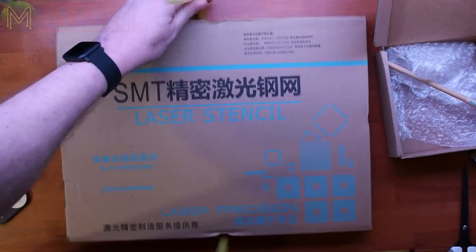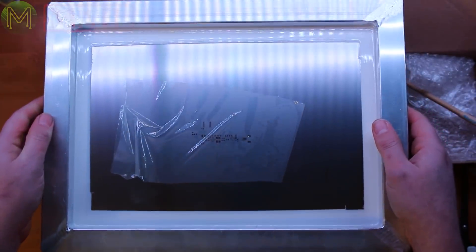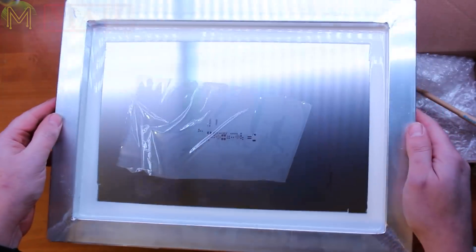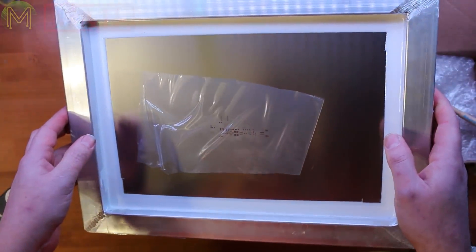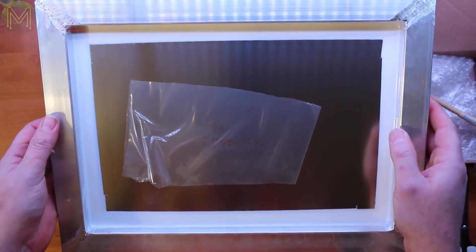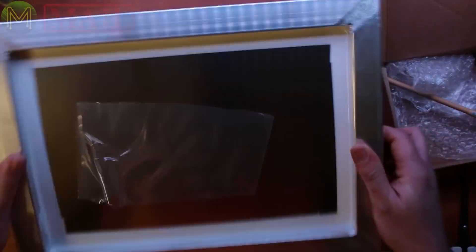As I mentioned, I also ordered a stencil — this time around I got it in a frame, because one of my mates, Keen, has a proper frame jig where you can actually attach it and make these in bulk. Considering I'll be making a lot of these by hand, at least for the first 50 or 100, I've got to make this as efficient as possible. A non-framed stencil just makes life a lot harder. When you're making PCBs by hand, the most important thing is reducing the time spent on each individual step — two seconds here, five seconds there, ten seconds there, it all adds up when you're doing 100 PCBs. You also need a reliable, repeatable process with no failures.